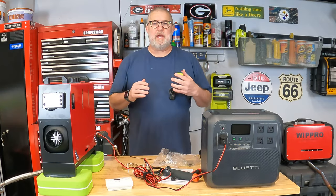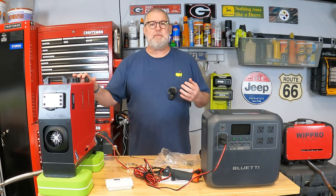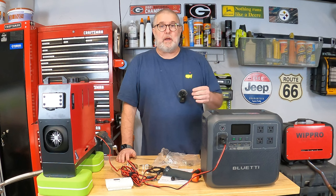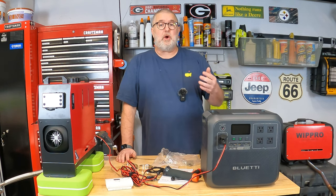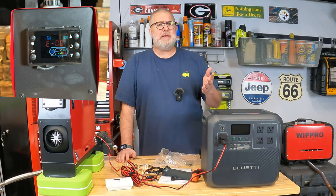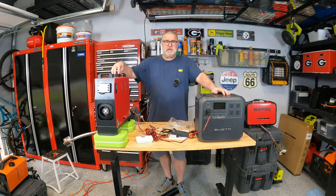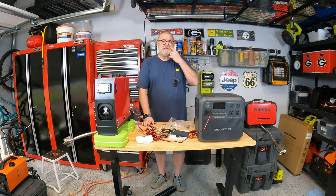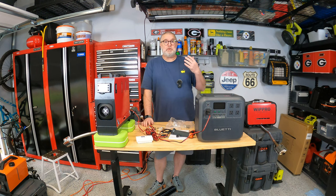This was super simple to put together. We just unboxed it, hooked up the intake hose, put the exhaust and muffler on, wired it up, put fuel in it, and turned it on. That's all you have to do. There are error codes in the manual if you need them — I have never once hit an error code other than error code eight, which means it's basically out of fuel. I'd like to show you how hot this is after running for about 30 minutes on low, then turn it up to high, and then do some hard testing: low with one gallon of diesel fuel to see how long it'll go, then high for the same test.